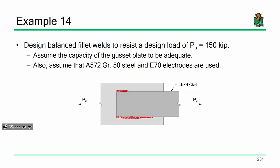Would it be ideal to put a transverse weld directly at the centroid? That's a good question — you can put a weld right there and account for it during equilibrium. We're actually going to do that for this example, putting a transverse weld at that location. Once you understand how to do that, you can do one without a transverse weld by setting that capacity equal to zero. Next time let's try to power through these weld examples so you're prepared for homework 5 on Friday. After welds, the topics in this class are going to take a complete 180 — up until now we've been talking about fracture and yielding, but with columns and beams we have buckling to talk about, and it's a completely different story. Welds will be on the final, not on the sub-exam.